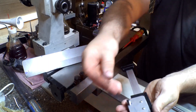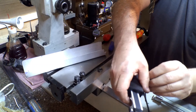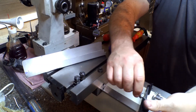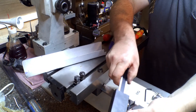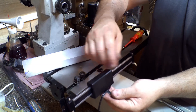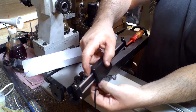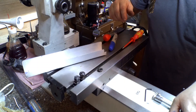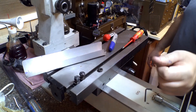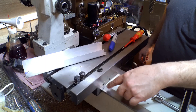There's a spacer I made to space out the plate - I had to make this little mounting plate. I got the right size bolt, put a nut on there at the exact spot, basically red Loctite'd it in there, and the wire goes over the bolt and basically stays there so the wire's not even moving. The scale's moving, not the wire, so there's no worry about the wire wearing away. I'll just tie it up around the back of the scale. All I had to do was drill tap a hole here, drill tap a little hole there, and for the reader I used one of the holes for the steady rest or follower rest mount that the factory had in there.